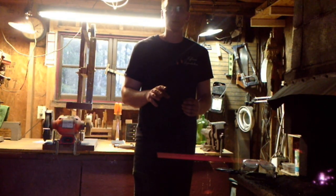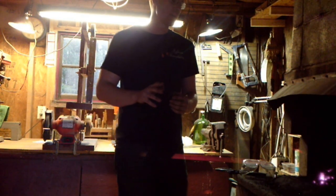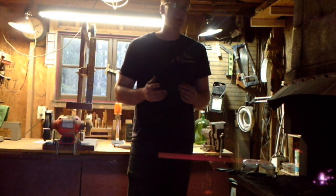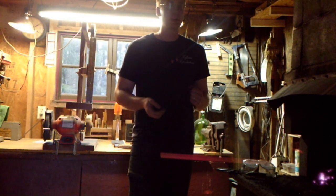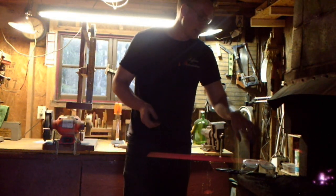If you've never done this before, the lower carbon content — the 1070 or the 1080 — I would recommend because it's a little more forgiving. You can be a little off with your hammering, forging, and heat treating and not have as many problems. If you up the carbon content, you have to be more careful or you end up with problems. The piece I've got here today is 1084.